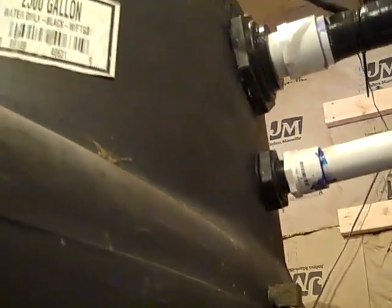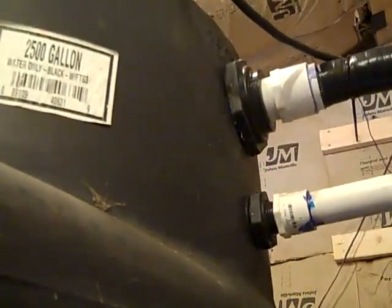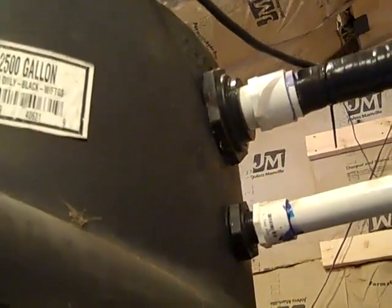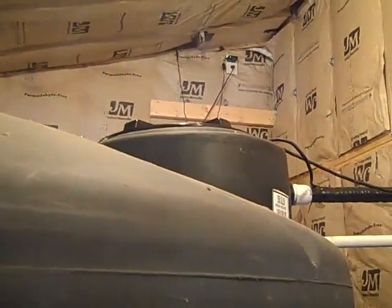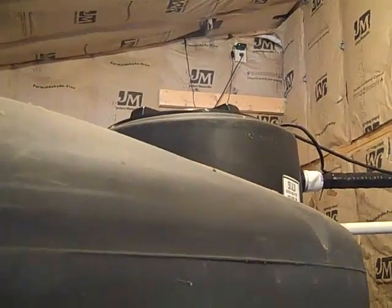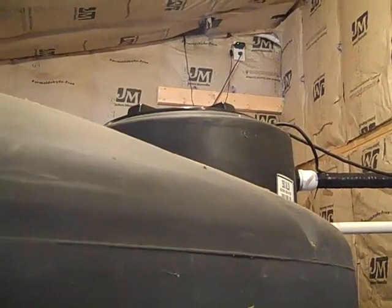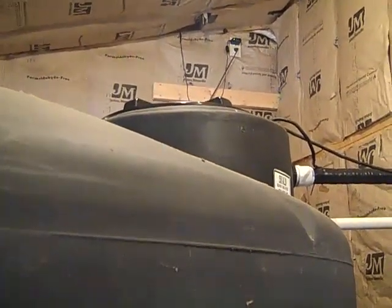All done with the Dankoff slow pump, two solar panels, lots of wire, lots of digging. If you have a spring and it's below you, you can lift that water even up to 580 feet in elevation. Just got to spec it out right — make sure your wire sizes are right, voltage drop calculations are done correctly, friction losses — everything must be taken into account before you get into this much work. But when it's done right, it works. We do need to cut a tree down; you start seeing your solar window in production and you need to clean that up.